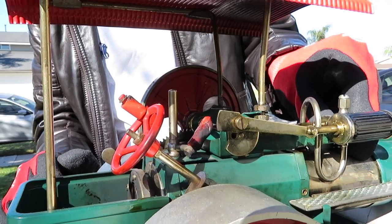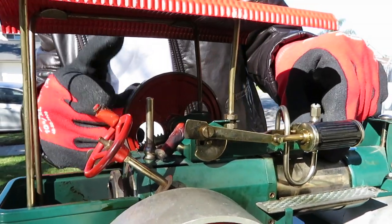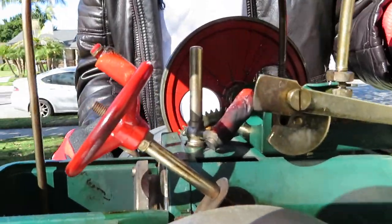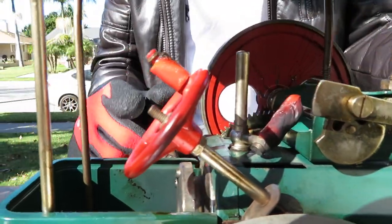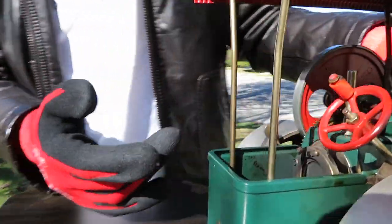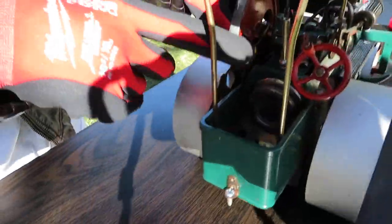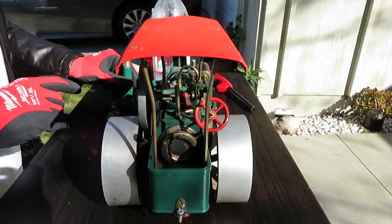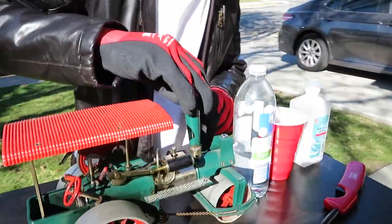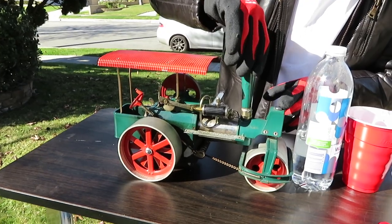Valve gearing seems to be going fine as well. The whistle valve, although a bit tricky to handle on this model in particular as it's always in a weird position, is closed — we have to make sure it's in the closed position. We also have to check if there's water in the boiler. Here in the back we have a nice big round gauge glass, or water glass, and it's around two quarters, maybe halfway full. That is perfect — we don't want to fill it up all the way as we need room for steam. Now that we're almost ready to steam up, let's slap our funnel back on. Exhaust steam goes through the funnel after it's used.